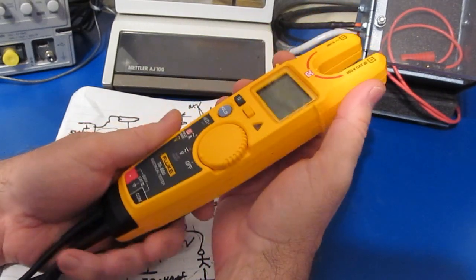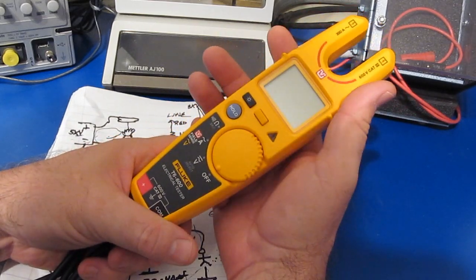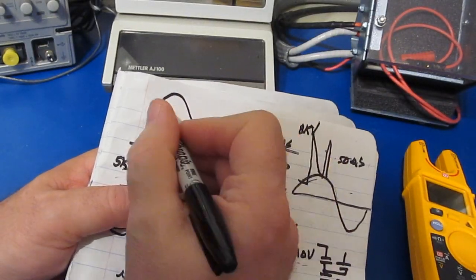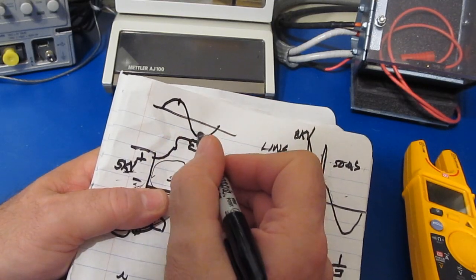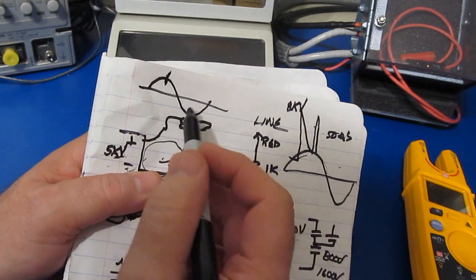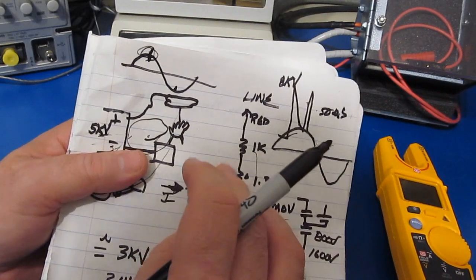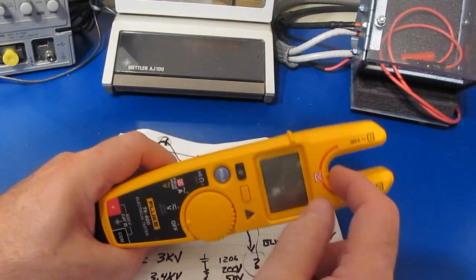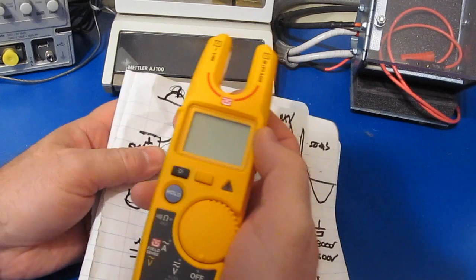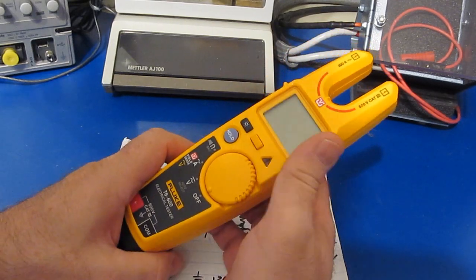We also saw it had a lot of problems with that waveform with the ringing on it. I thought it may have had something to do with the zero crossing, but some of those spikes are actually up in the peak. So if you go back and look at those waveforms, here's the sine wave and I'll put a little peak here, or just put it on half of the cycle — I may have it go positive or negative, just running different combinations of that. Even these little humps were causing this meter to have troubles. It's quite surprising — however they're doing this non-contact detection, this needs to be a lot more robust. I'm just surprised that it misses such simple waveforms as this. Well, that's going to be all for now — until the next video. Later.